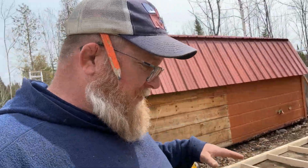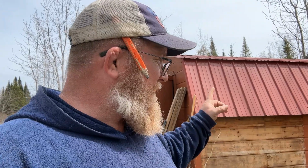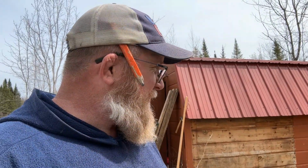Once I get the blocks down, the next step typically would be to make sure everything's level. However, this building has sunk. Trying to level this shed right now with all the equipment inside of it is futile. So what I'm going to do is get the level of the shed, and then level the wall to the shed. That's the same method I used on the other side. Seems to work good. Ideally, I would like to at some point level this building off.